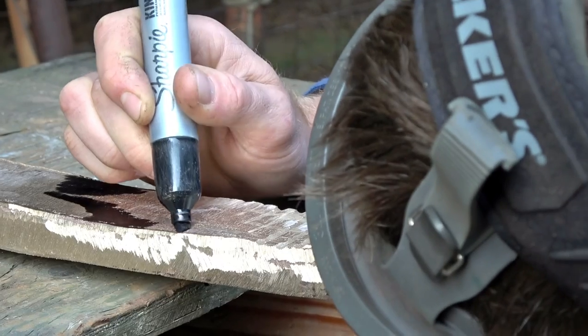We are still working really hard on the bronze work, casting and fitting the hanging and lodging knees and the floors. It's going really well and we've sped up our production time at the foundry. We're now producing an average of 2 pieces per day. So this week we're going to be focusing mostly on the fitting process for the hanging knees, but we're also making rivets, fastening floors, and of course we're going to have a little bit more bronze pouring footage for you too.